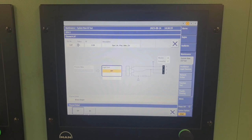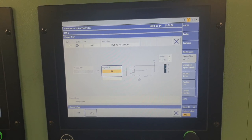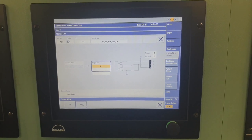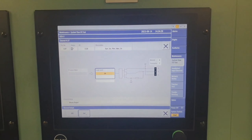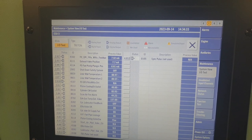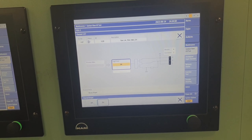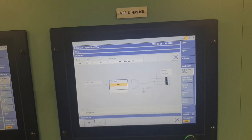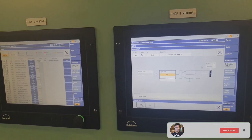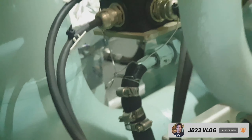This is how it looks when it is in input and output test. Just select the start air pilot valve and from the other main operating panel you can switch on and off to test the operation of the solenoid valve. Select which cylinder control unit we have to carry out the input and output test, remove from normal, and then you can choose switch on and off.